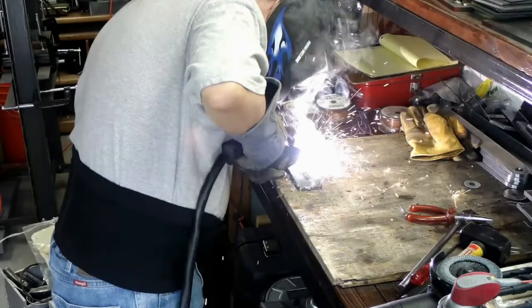At my buddy Tom's recommendation, we used the air compressor to blow out as much of this debris as we could, which really wasn't much. And then we took some clean steel welding wire and a rag with some WD-40, lubed the wire as we passed it backwards through the wire transport sleeve, and this eventually unclogged the pipe and allowed me to finally run some softer flux core welding wire through the sleeve and do a couple test welds. I removed the welder from the cart, took it to my friend's house, and was able to fix his patio chair with no further issues.